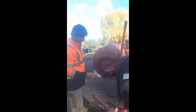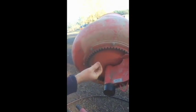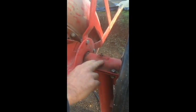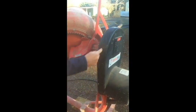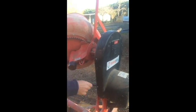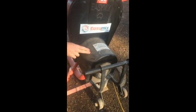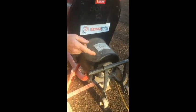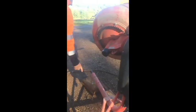For maintenance, give all the gears a good cover of grease. There's a grease nipple to grease inside the housing, and a fan belt — take the cover off every now and then to check it's in good condition. The motor uses a lot of power, so like a compressor you need a high-quality lead and keep it as short as possible for good electricity supply to the motor.